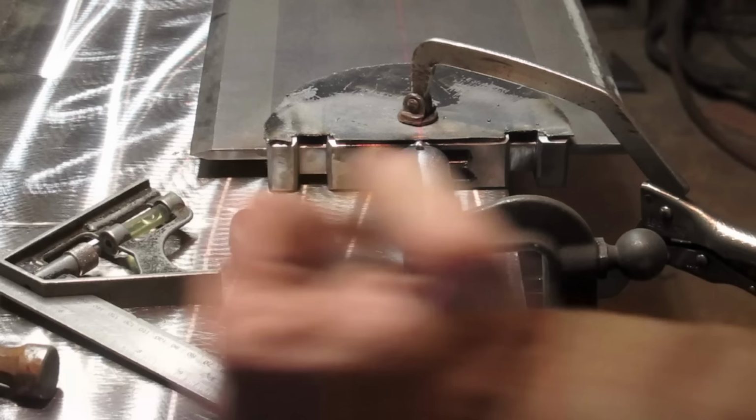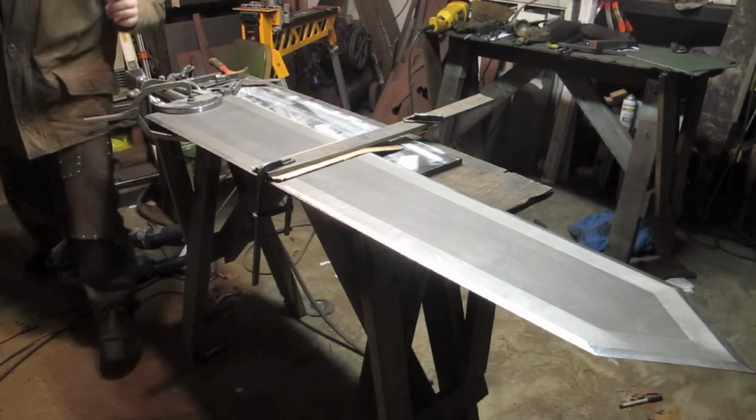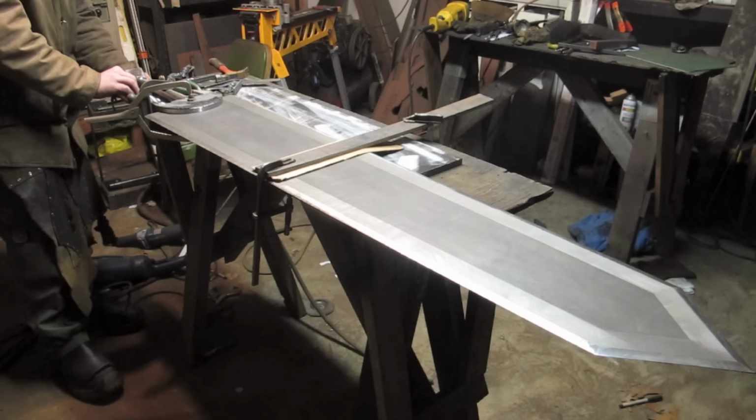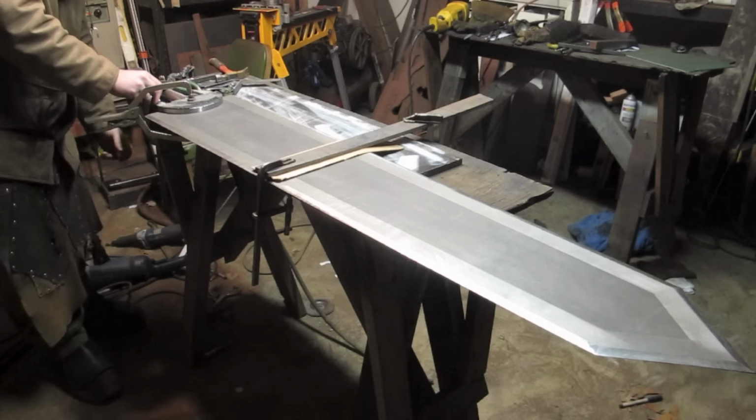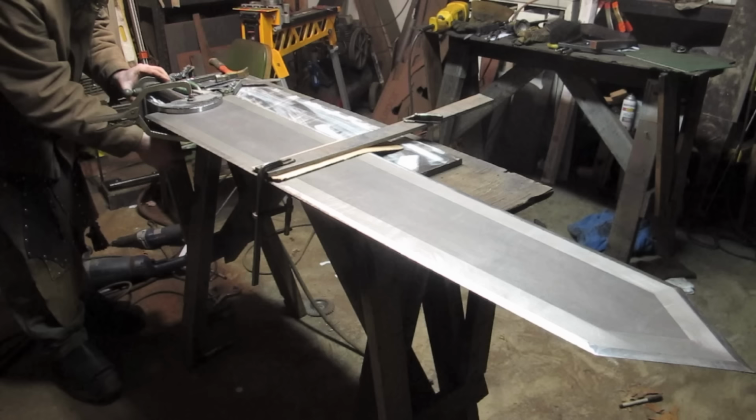This guy needs to come over here, but when I had this clamp here, because of the nature of it, it was sliding on me. So tacked here, I can now move the back of the handle into position while keeping this one in the place where it needs to be. The blade is locked down flat so it can't move. So I unclamp this guy. I drag this guy. Huh! Curse my good welding! Usually when you just have one tack, it's nice and polite and moves for you. For whatever reason, this one isn't. Maybe I should clamp it tight and then tap it.